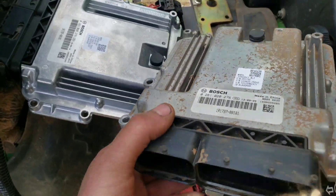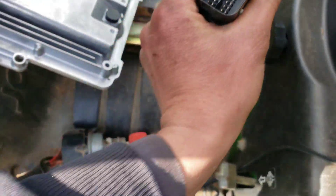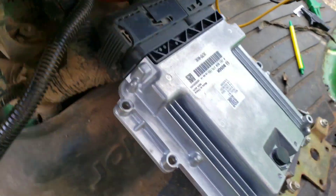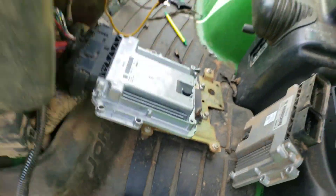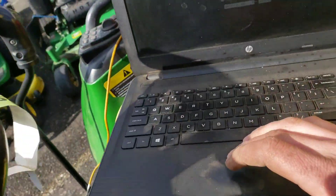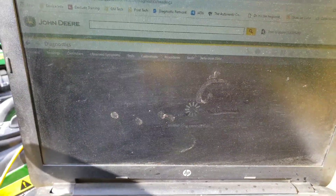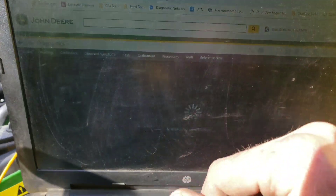So we got our old cruddy dusty one out — no corrosion, pin fretting, bent pins, anything that I can see. Same with the connector side, these are just kind of a pain to do one-handed. We threw our donor in there, which I pulled off another machine. We're going to key on. The only code this may throw — which it didn't right away because we didn't fire it up — is a VIN mismatch. Yes, there is module security in these. I don't condone just swapping ECUs or any kind of parts in or out without proving it, but this is quite literally the only way we have to prove the assumption at this point.